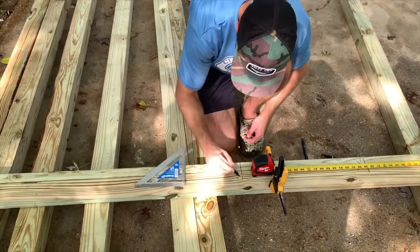For the fourth row of shingles, we're going to trim 17 inches off this time. After this fourth course, the fifth course is simply going to use a full shingle again, and we're going to repeat this process using a full shingle, then trimming 6 inches off, then trimming 11 inches off, then trimming 17 inches off, and then restarting. So repeat this process all the rest of the way up.